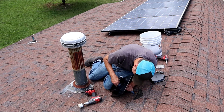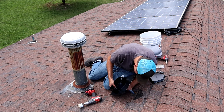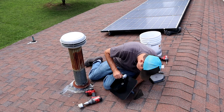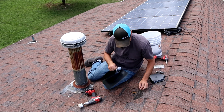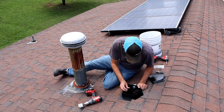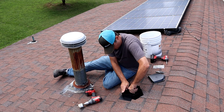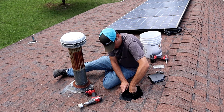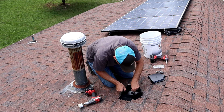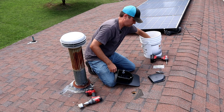You're right under this hole? I'm going to take this off the box — I need you to pull this tube back. Once I have the box in place, I need you to push it up, because I can't get it under the shingle with the thing in place. Pull it back down. Push it into that hole. Hang on — I forgot one step, I got to put some sealant under it. I definitely want the sealant.